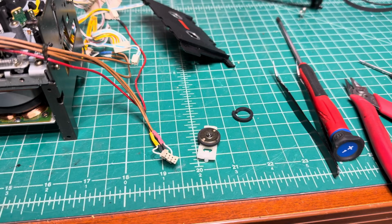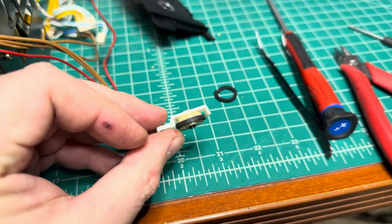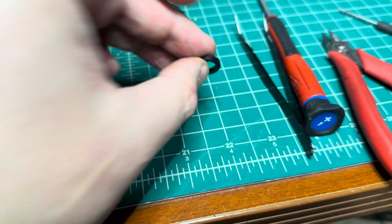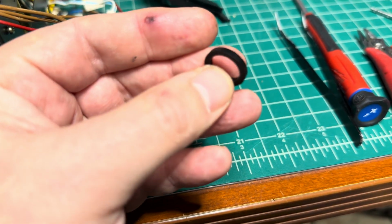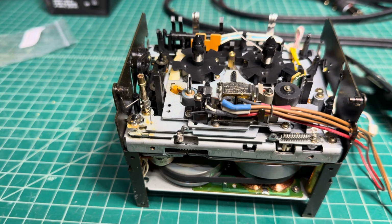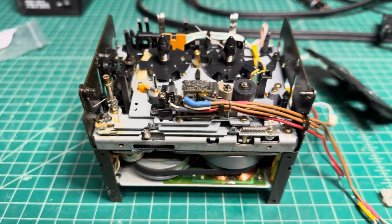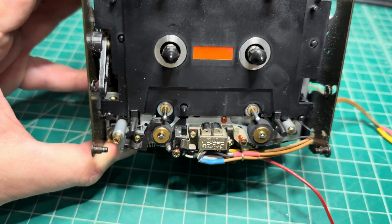See you soon. And welcome, new idler. See, it's matte, and the old idler is plastified already. All right. Now we'll assemble in the reverse order and then install the pinch arm and roller from the donor deck. And let's see how everything will perform. See you soon.